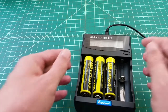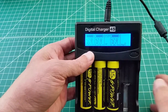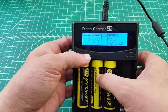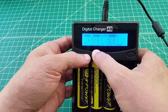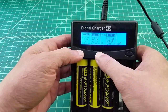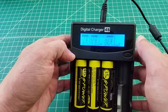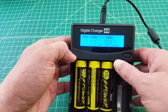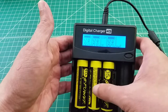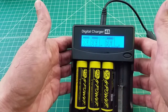After test number two, the 2500 mAh battery overperformed again, which is what we expected. The 2600 mAh battery underperformed slightly, but not by a significant amount. The 3000 mAh battery underperformed by a few hundred milliamp hours. So the 3000 mAh is the one I'd be concerned about, while the other two perform close to spec or better. I wouldn't have any problem buying the 35 amp or the 40 amp at 2600 mAh. Thanks to G-Power for sending these batteries out for testing.